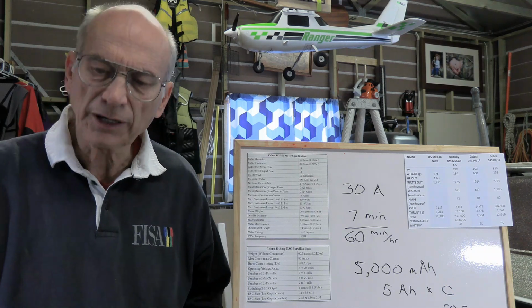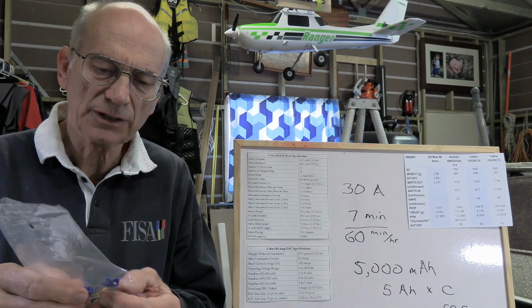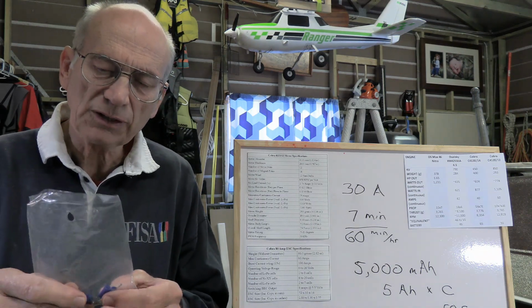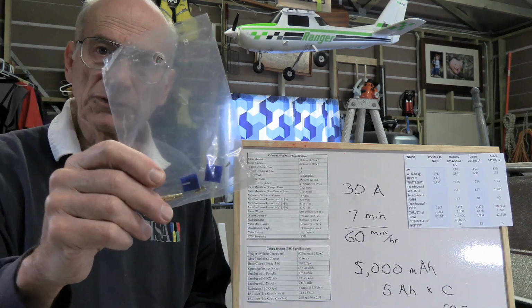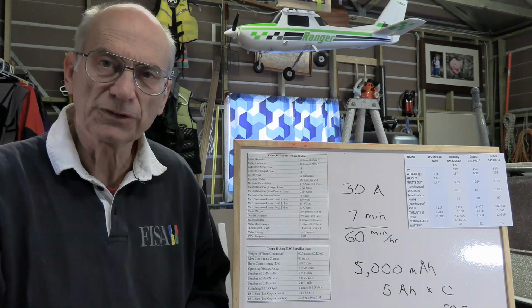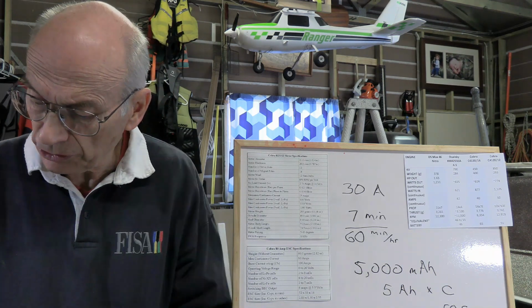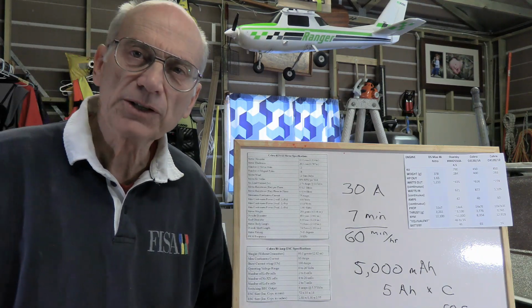Of course, with the ECs or ICs, you've got the EC3 and the EC5 and so forth. So EC3 would be a bit light on. That's what this one is. Probably go up to the EC5 if you're using those. And then, of course, there's other varieties of connectors as well. But make sure you use connectors that are rated properly, and make sure that they get soldered on really well.